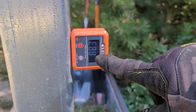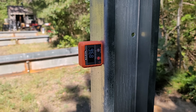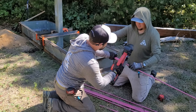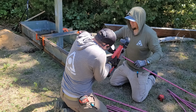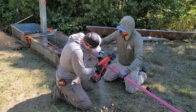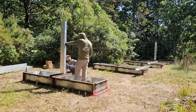The yard is on a slight hill so we match the tilt of the yard so the bottom edge of our solar panels is the exact same height from left to right. We need to come up to 90 degrees for our posts. If you haven't used pink fiberglass rebar before, it is very user-friendly and only costs about 10% more than metal rebar — it's very lightweight, flexible, and easy to work with. We're putting in two rods of rebar to make sure the post can never come out of the concrete, and cutting multiple pieces at once with a bandsaw is extremely easy. We'll use small pieces as cross members against the other rebar to make it even more rigid.